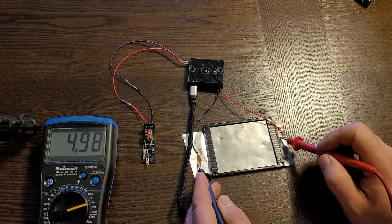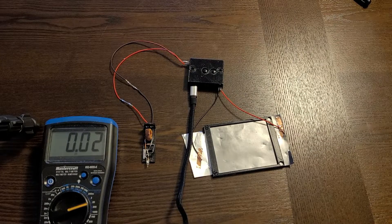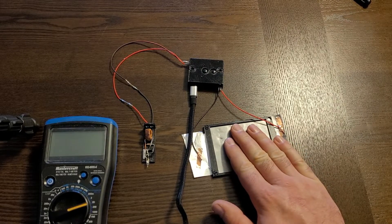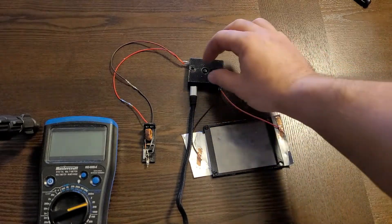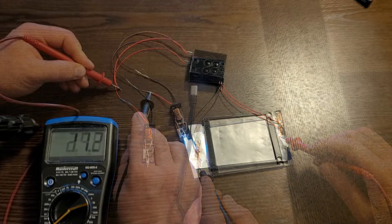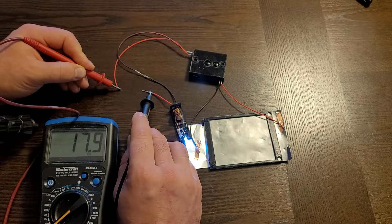I also want to mention that when I was playing around with the recharge times with this cell, I found that any times over 30 seconds didn't seem to increase the cell power output. So whatever mechanism is taking place here happens very quickly within that first 30 seconds. After letting it charge for a couple minutes, I even noticed some heat starting to build up in the cell, so I didn't try to recharge it beyond that. After the recharge, the results are much better. The cell voltage is sitting at 2.6 volts and produces about 20mA under the load of the test LED. On the downside, it doesn't have that much longevity — after 6 minutes, the charge is almost completely gone.